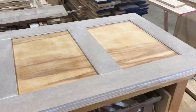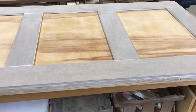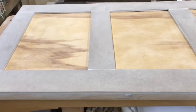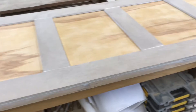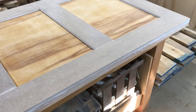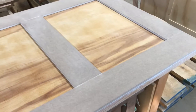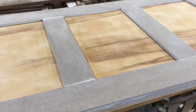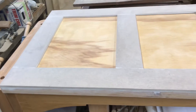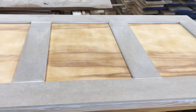The hardware we bought was good for one and three-eighths or one and three-quarter inch doors, and we happen to have one and three-eighth slab doors on the closet. So I got some three-eighths MDF, made some strips, and glued them on. I sanded the door down real well and used some joint compound on the edges. Clamping these down was a challenge — I had a caul across each cross piece and just about every clamp I owned on the thing, but it came out well.